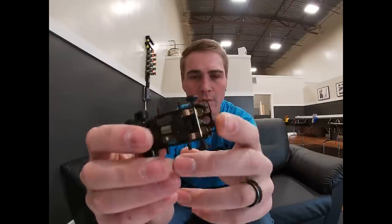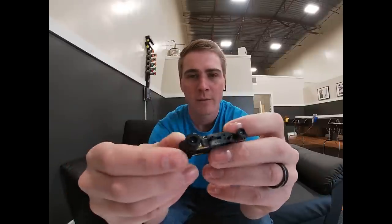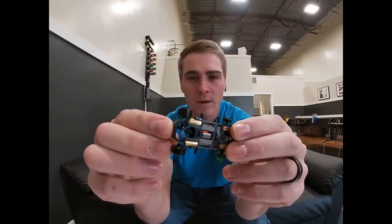Hey everyone, we're down at the shop today talking about our next video. Today we're going to talk about my favorite class, the Viper Jet. This is a brass weighted car where we put weights in the front of the car and replace the traction magnets with weights. The car is set up a lot like a super stock or a spec racer with a flexi chassis, lower tires, soft rears, 7/23 gearing, but the kicker is we run them on 12 volts. They're a real handful to drive. We're going to build one today and see what we can run on our shop track.